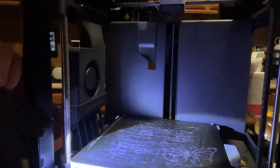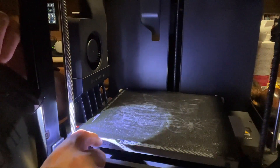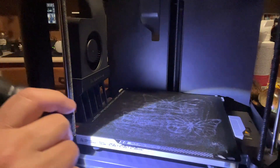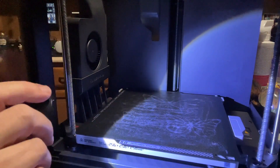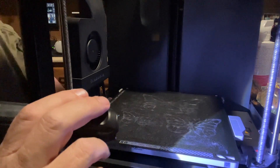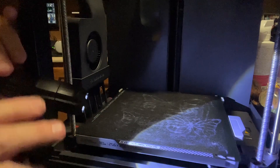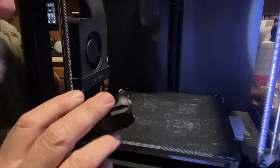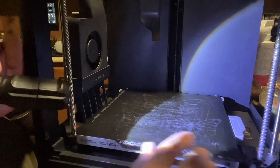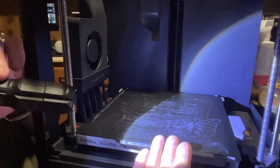You'll notice right up front — if you look straight down, you should see a little bit of white from the front edge of the bed just forward of the build plate. That's the main error. For maintenance on the screws, I've seen some YouTube videos where they've added oil, but it actually says to add grease. There's a little package of silicone grease that comes with it. All you want to do is bring the build plate all the way down, take a little dab and just run it along the screw to spread it out, then bring the plate up and down to cycle it through.